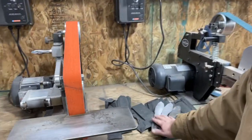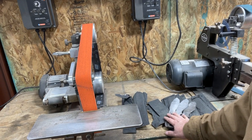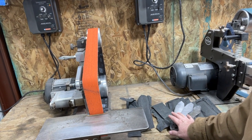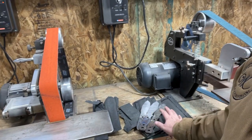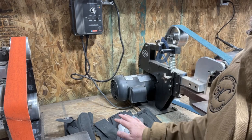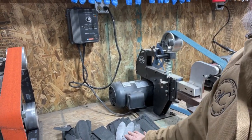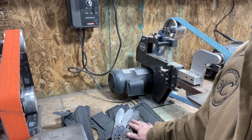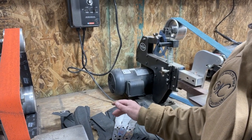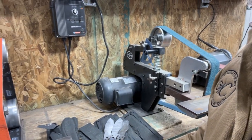And all of these are the 3V custom build WCSKs, okay? And there's going to be like 15 of them, 500 through 515. They're heat treated. I'm taking them out of the foil packs, getting the carbon off of them so I can do the Rockwell testing on these. The Rockwell is going to be between 58 and 60, right in there on the 3Vs, okay?